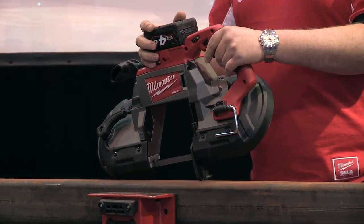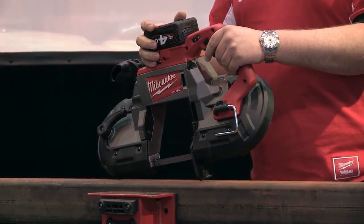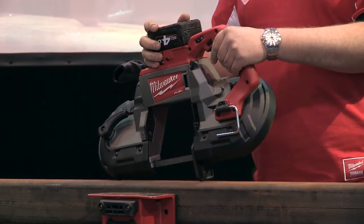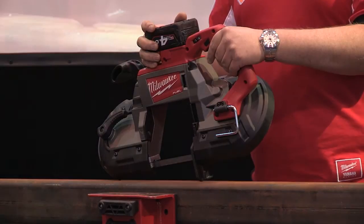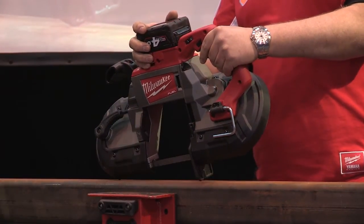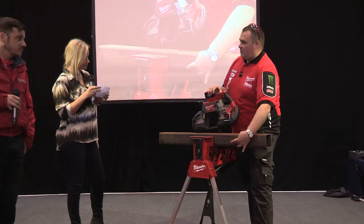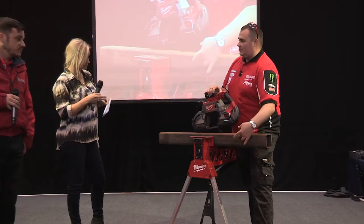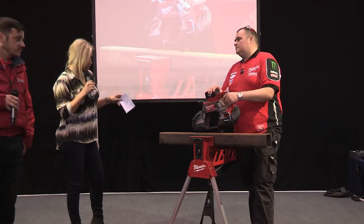That's not too bad. You've also got a little light on there — yes, for using it in the dark. Now, can you cut things at an angle? Once you've got a bit of experience with it, you can cut at an angle. You've just got to remember that when you start cutting things at an angle, the actual depth of material gains in size. You've got to remember you still have enough capacity to clear what you're cutting.